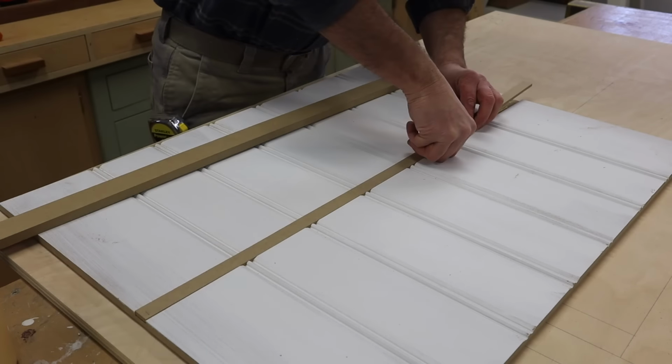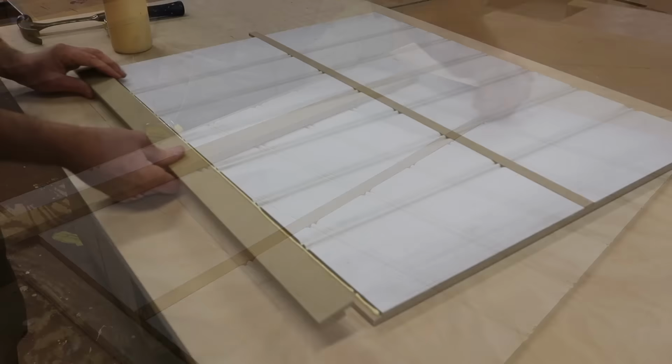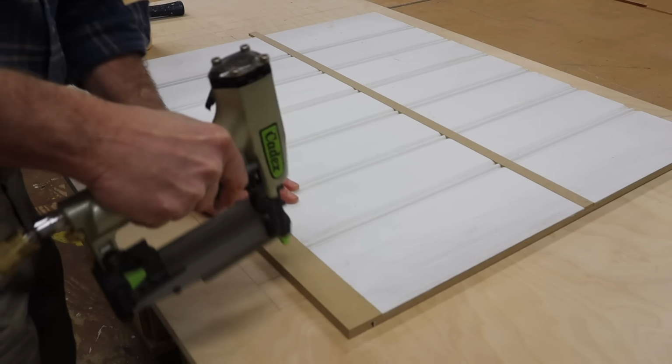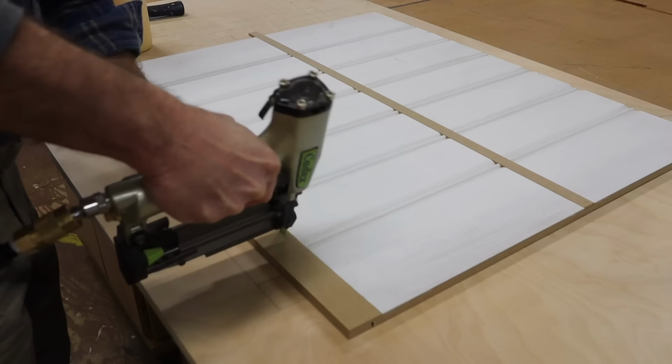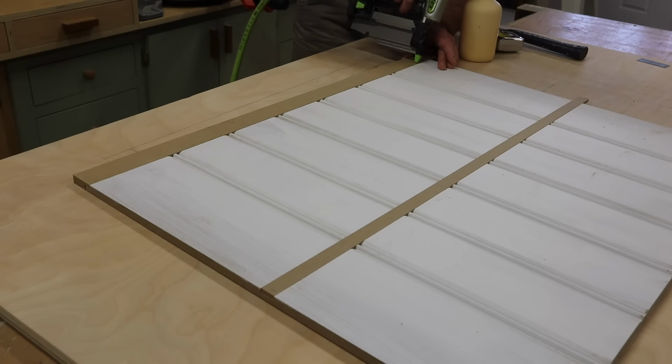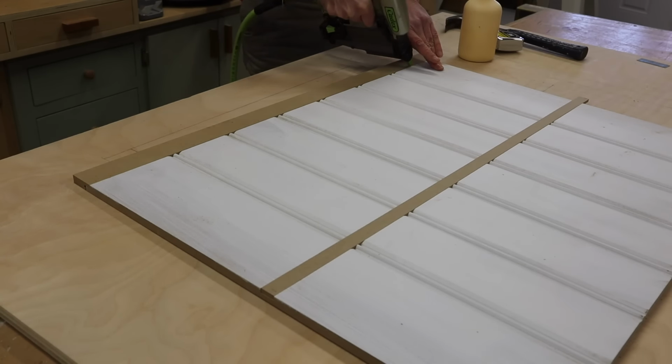I used a lap joint to add a piece to the bottom of the back simply because the piece that I had wasn't big enough, and this was faster than running out to the lumber yard. But just keep in mind, the plans will only call for a second dado at the bottom of the back, and the measurements will be provided.